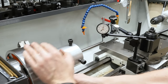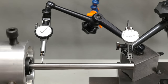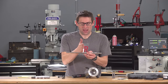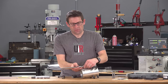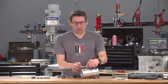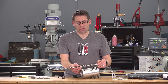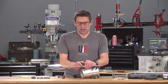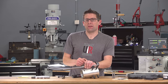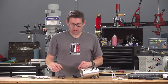With a large portion of the indicator rod sticking out the end of the jig, I put two dial test indicators on it and made the appropriate adjustments until it was running true. My philosophy: start with the radial adjustments near the end of the jig — you want to move in those directions until that area is running true, then focus on the outboard end, using the opposite set of screws to work on rotation until that's running true. That will slightly throw off the radial alignment, so you go back, get the radial set, then go out and get the angle set, and so on, until both indicators are reading within about one to two ten-thousandths of an inch total indicator reading — adequate for truing the receiver.